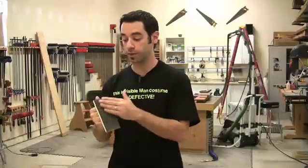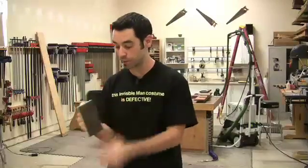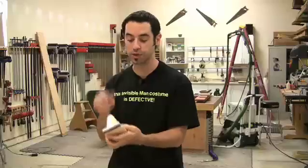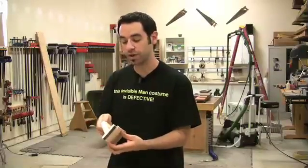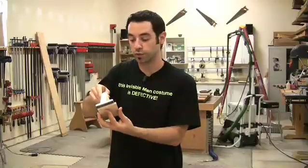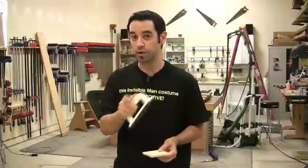For me personally, the best thing is my little foam padded grip that I use for my jointer all the time. You can use them on the router table. This is going to give me the most surface area coverage and the most control over this piece. My fingers are going to come a little closer to the blade than I normally would like them to be, but I feel pretty secure because I'm holding this piece of plastic and there's really no chance of me slipping off and hitting the blade. So that's what I'm going to use, but you got to make sure you think about this before you make that cut. What is the safest way to do it?